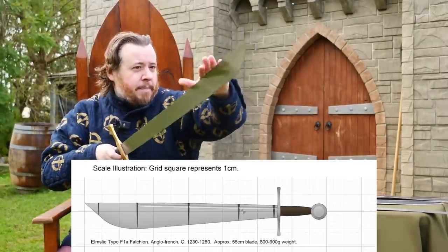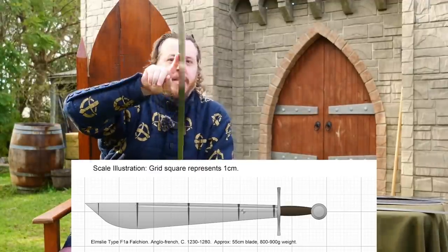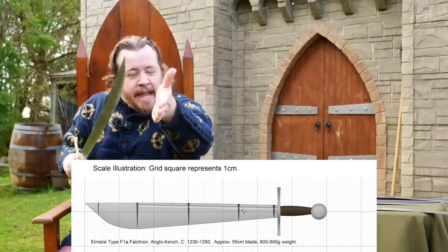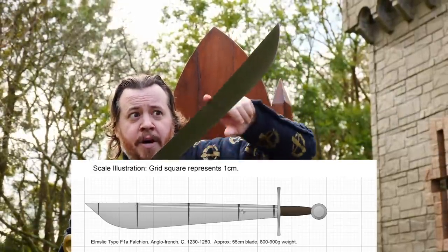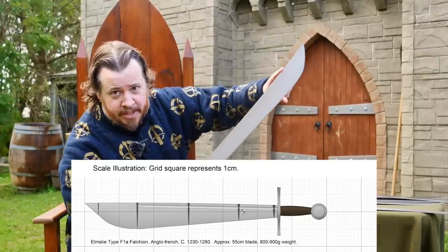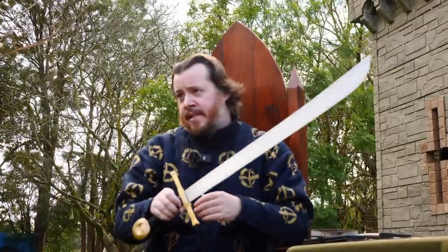There is a stronger kind of tapering from the spine of the blade down to the edge. If we had done that on this blade, it would have been too light overall — since we already hit bang on the money in weight, we didn't want to remove more material. Also, this blade is already 1mm thick at the tip, where the standard type is about 1.5mm, which gives more meat to grind down and create a taper angle — basically a bevel along the whole length from spine to edge. Because the surviving examples have that gradual bevel, even though the spine might be around 1.5mm, the actual flat of the blade gets even thinner than the spine width. So even without that beveled profiling on our falchion, overall the width and weight of the tip is actually quite close to what the surviving examples would be.